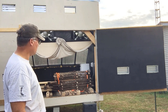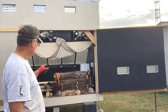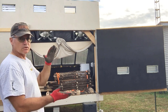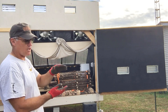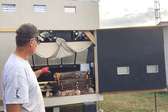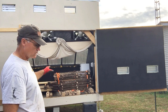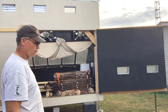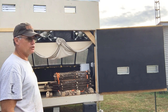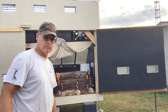What you see there in the picture — I cut a big limb out of the walnut tree down by the swimming pool, then I ended up slabbing it. One thing I did not do is put the ratchet straps on it to squeeze it down, and as it started to dry it was bowing out, so I got that taken care of this morning. I slabbed that up on Wednesday and today is Saturday, so it's been in there just a few days. Hopefully it'll still be fine — it's some beautiful wood.